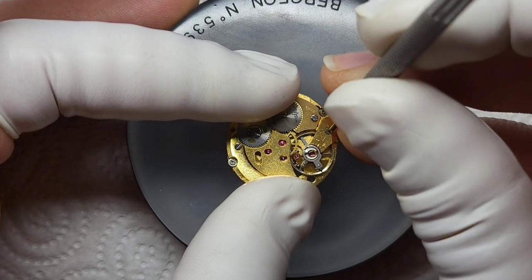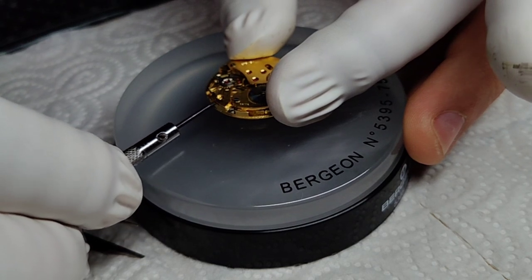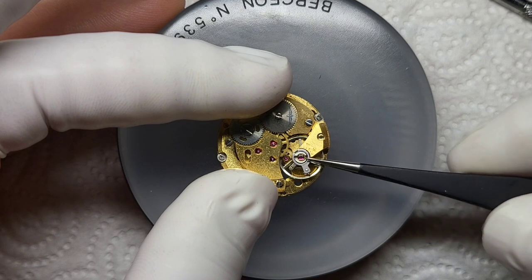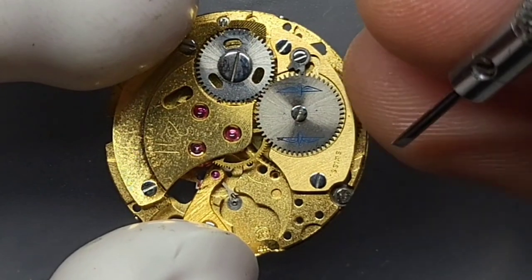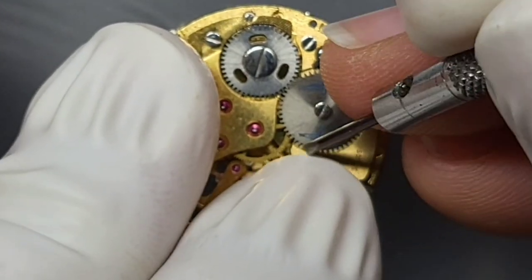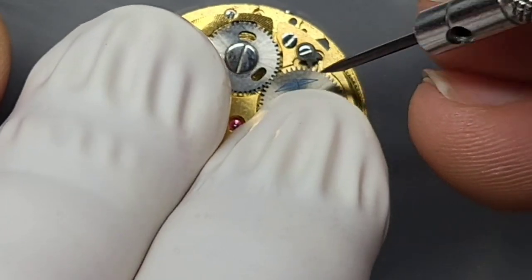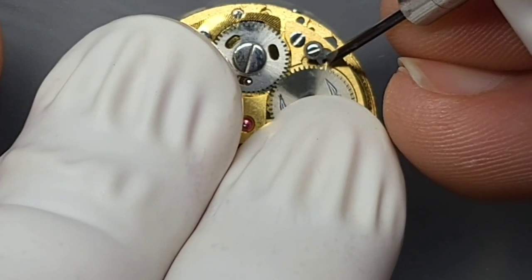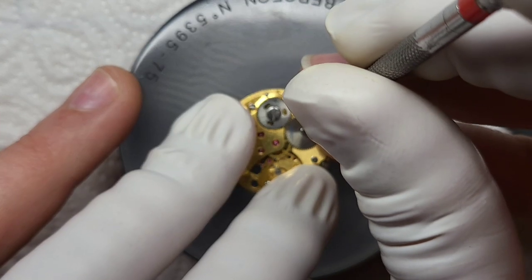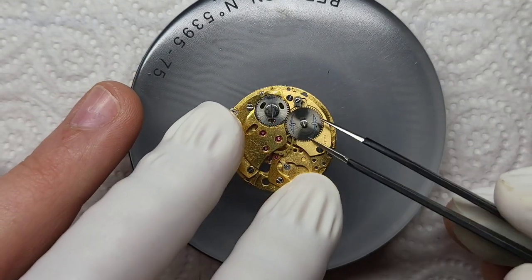The first thing we're going to do is remove the balance wheel. The balance wheel is an incredibly sensitive piece — it has a hairspring on the side, so called because it's the thickness of a human hair. If you pinch or crimp it, it's all over — completely knackered. We can see we're on a Rotary watch because of the printing there. What I'm trying to do is let down the mainspring — we know it had tension, so I'm holding off the click at the top and just allowing that main wheel to slip between my fingers. That lets me undo the screw which removes the first drive sprocket from the mainspring.